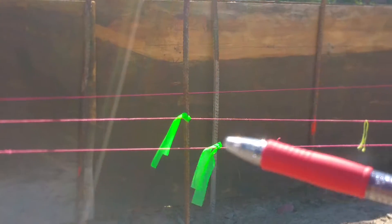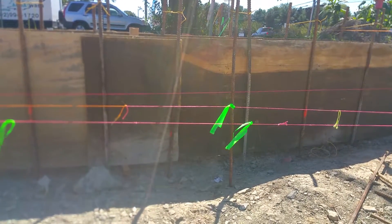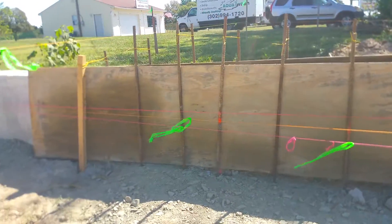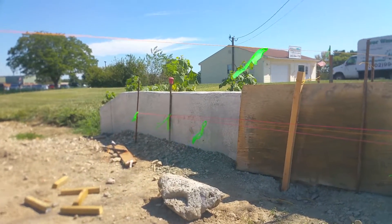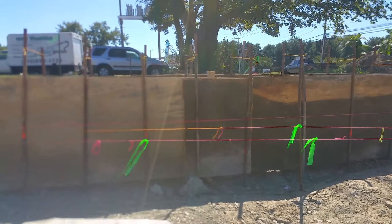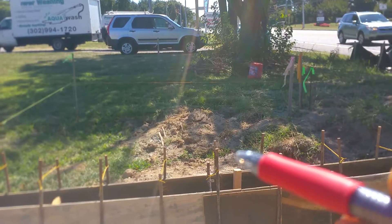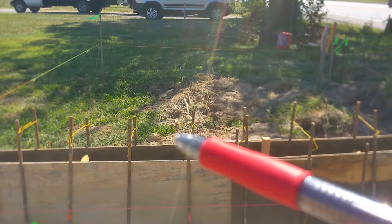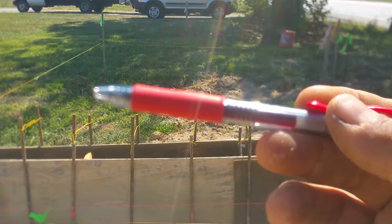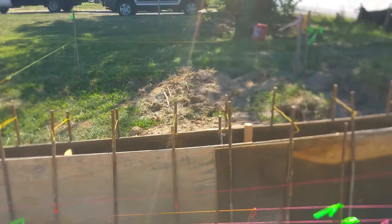So that's going to give us a little bit of a compound too when you do the asphalt. This is going to be resolved over here, and it's going to quickly be resolved in the field in the driveway section. That's just pulling it up there — the straight line pulled up there to resolve it on this side, not pulled up on the other side, because I've got the 8-inch curb to deal with. Resolving it here. This second line is roughly the proposed elevation, and that's going to be below — or right about equal to — the soil. We're going to go up, bringing that water to the driveway, pitching to the walkway, no more than 2% towards the driveway, and resolving any standing water issues that were brought to attention.